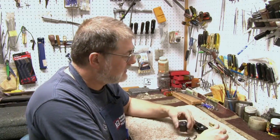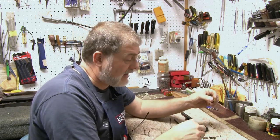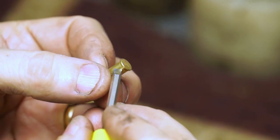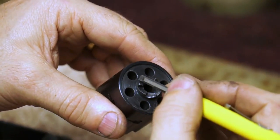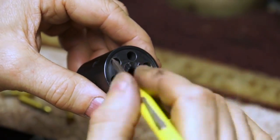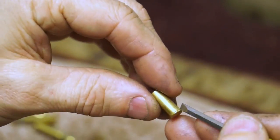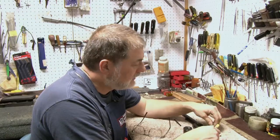The cases are just — I'm really not very happy with the fact that they're bulged all the way around. You can see that chamfer — it's super excessive. That chamfer allows the cases to go in further, giving it a little bit more headspace. So when they fire, they back out and swell the cases, making them little pregnant cases — little bulges right there.